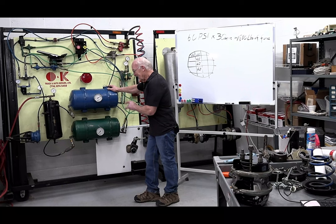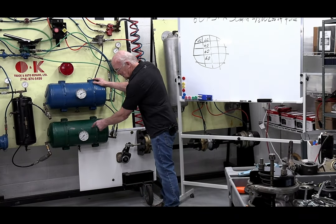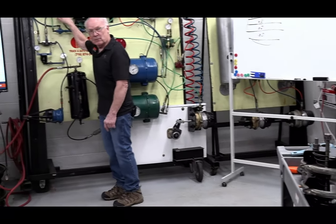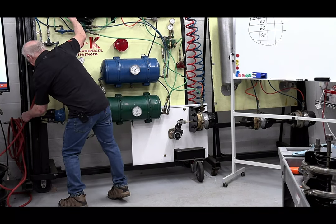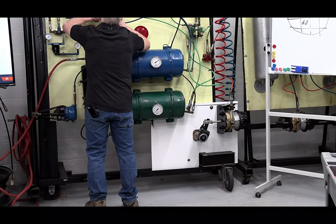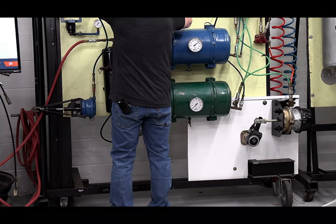But anyway, it's doing exactly what it was meant to do. What's gonna happen is, I am not gonna have all my brakes. I lost this guy here. What's gonna happen is when I step on my brakes, and Bobby, you're going to have to go from the front to the rear. I'm going to step on the brakes. I will not have rear brakes, but I will have front brakes. See that? I did not have rear brakes. I got front brakes, right? Everybody see that?